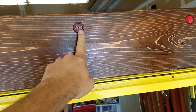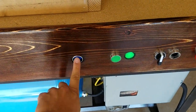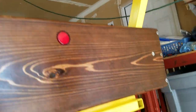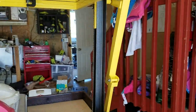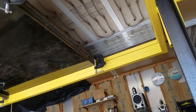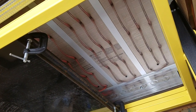There's a beeper that will beep when I turn it on. If I press the blue button, that's a cycle start. Now it'll start — you can't really see it from the light. It flashes quickly, saying it's already in a position, so I have to grab our arm up here, pull it down, and then push it back up. It beeped, and now I'll show it heating up for a four foot platen, then I'll flip the switch and it'll go to a two foot platen. You can see those starting to glow red.